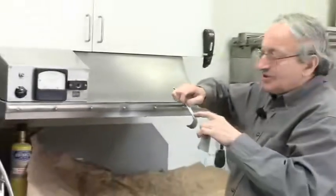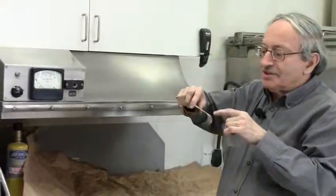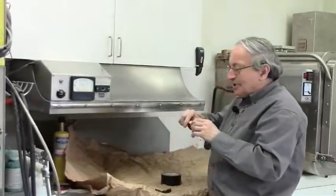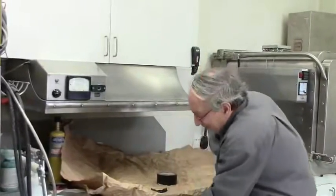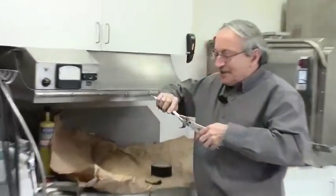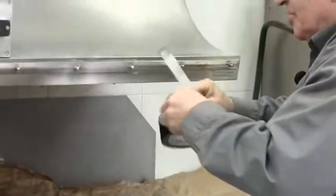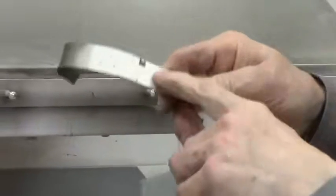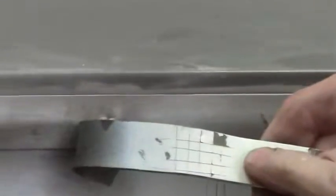Okay? Now this tape isn't that strong and this paint is not bad, so this surface was not prepared, but it's still borderline, because for example if you bend it a bit and then you repeat the test, see, it looked okay, but it's actually not a very good paint job, because if I bend it a bit and I repeat the peel-off test, now it looks bad. Okay, so what it means, it's not a real bond.